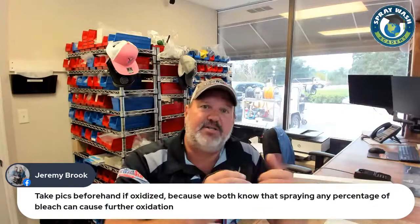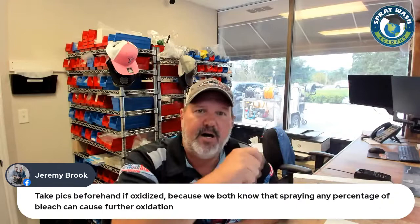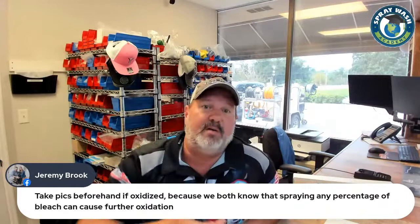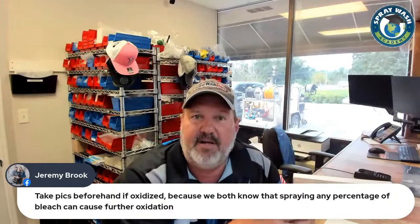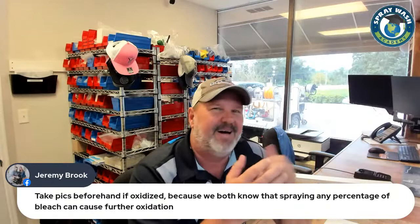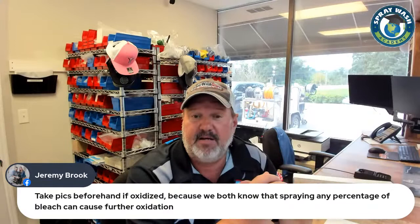So they install this color match plank, and then they go and touch it up with a little bit of the Sherwin-Williams paint that's on there. Well, the Sherwin-Williams paint color might actually last longer than the ColorPlus technology that's on the board. So now you clean it, the board's oxidized, the paint splotches are actually not. So your siding out there is now looking kind of zebra or cheetah spotted. So something to take into consideration.